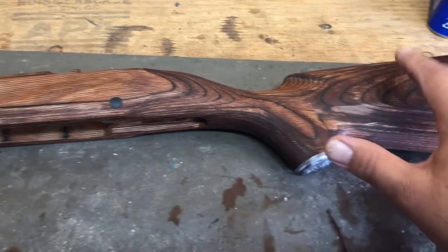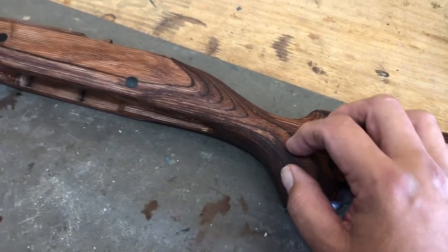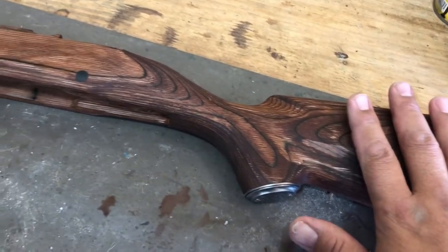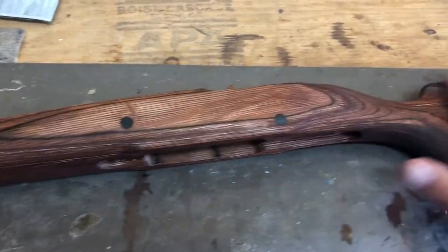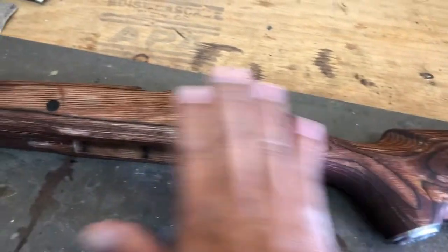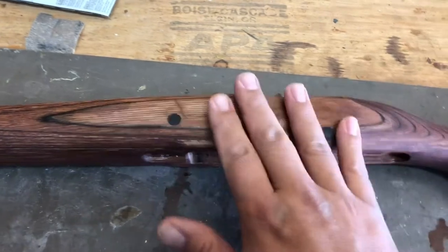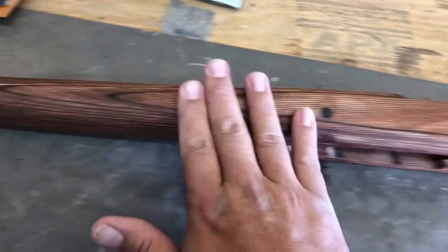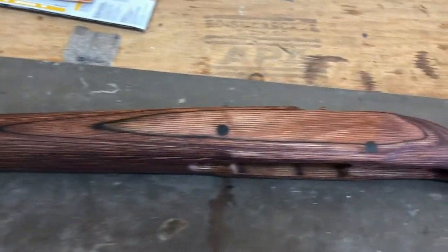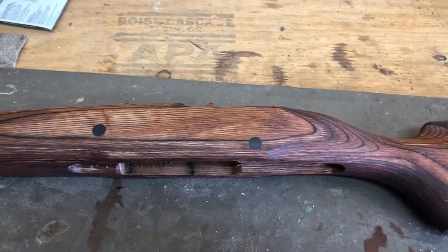What happened is now you put your sealer coat on it, the seal has gotten to the wood, and it's raised the grain a little bit, okay? So that's when we're gonna start sanding this down, okay? Between each one of these, you can sand it down. I'm gonna put another coat on this, but before I do that, I'm gonna sand this at about 320, 400 or so, okay? Then I'm gonna put another coat on. And I'm gonna do that a couple of times, all right?